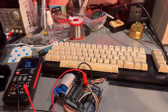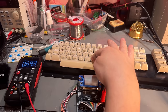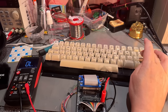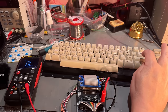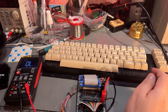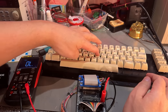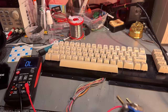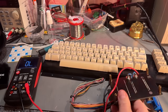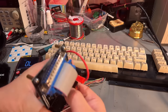Yeah, let's see if there's any change in the resistance. Okay, so some of the keys obviously don't work still, even if I clean them. There was an issue with the return key and it's still there, but now all the plungers have been randomly rearranged. So I think simply there's some break in this keyboard. And pushing hard doesn't help. Yeah, maybe there's a break in the wires or in the keyboard membrane itself, but that's gonna give me a lot more work. Well, maybe it's just a bad contact. I'm not really sure here.